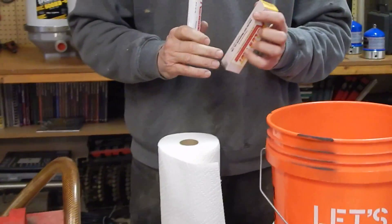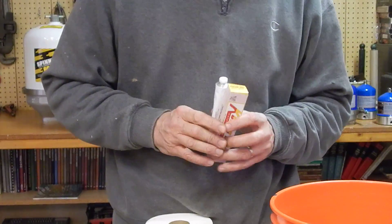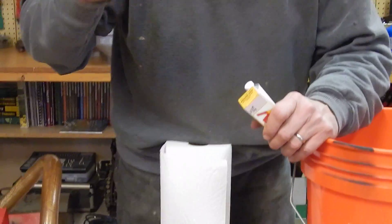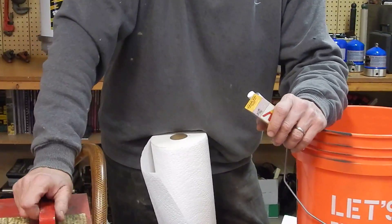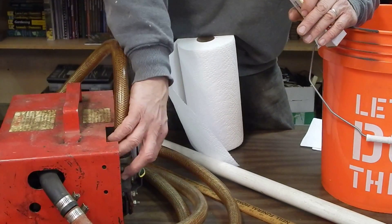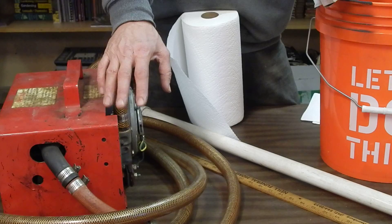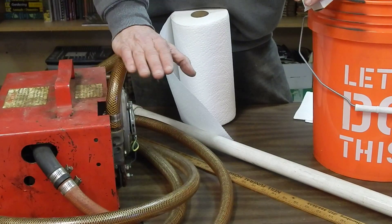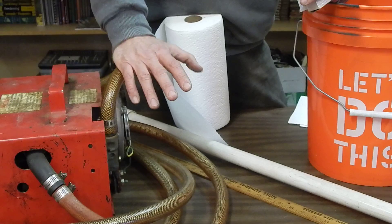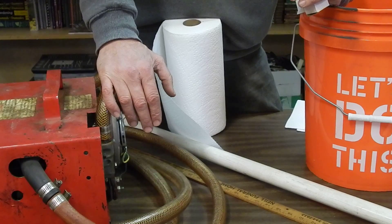I take my color marking paste. This will find water that's in the bottom of the drum. This is the critical point when picking up your oil. I don't know if you've ever heard of an emulsion. An emulsion is when there's been water in the bottom of the drum and you're running it through a gear pump. Every pump you're using, if you're not using a vacuum system, is a gear pump. It will create an emulsion. And basically, it doesn't matter if it's veg oil or motor oil — they're a bear to break. You can break them, but there isn't a centrifuge you're going to run it through once and have it separate. It's just not happening like that.